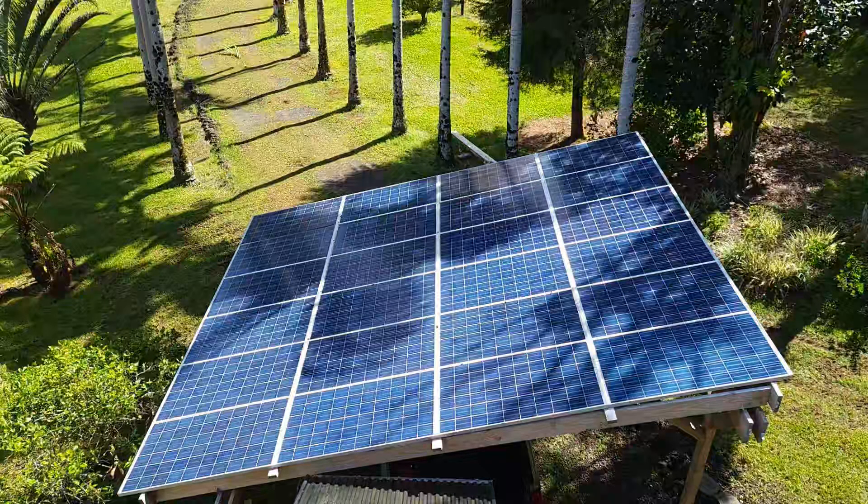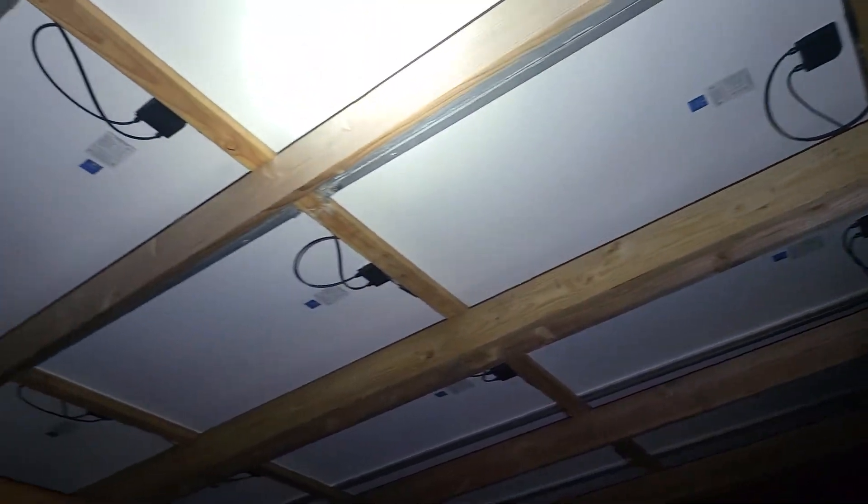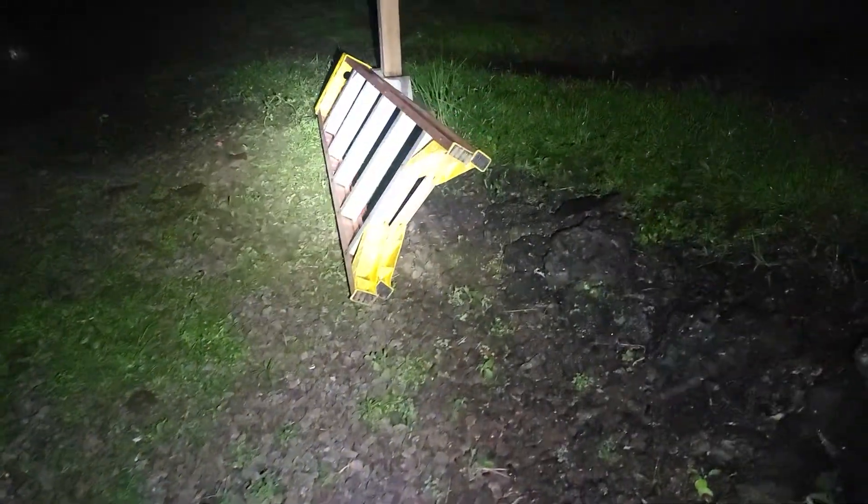It's about five o'clock in the afternoon with significant shading on the panels. I have full sunlight from about 8:30 in the morning till about 3:30 in the afternoon. The solar array at full power should be producing approximately 5.7 kilowatts, charging a 19-kilowatt battery pack. In any 24-hour period, this structure wouldn't see more than maybe three or four kilowatt hours of use, so it shouldn't take long to keep the batteries topped off. It's raining out at nighttime and there are absolutely no leaks from anywhere on the array — the butyl tape does its job.